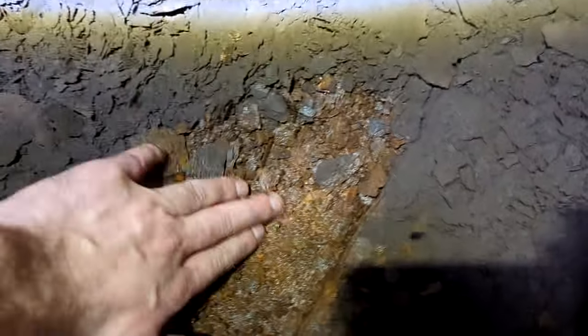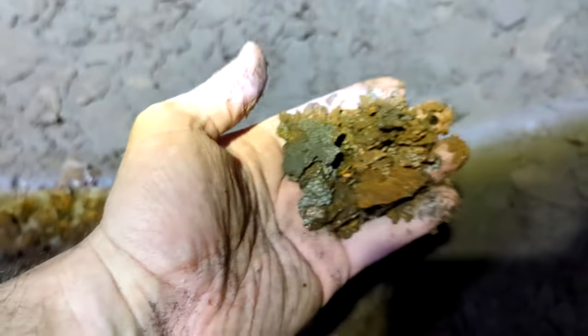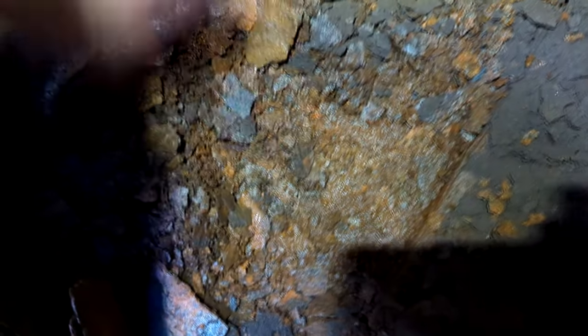I have a light down here. So this is what the inside of one of our tenders looks like. Up there there's a slope sheet where the coal goes. So this area would have all been water. You can see over the years just what holding the water has done to this tender — it's pretty rusty. If we look at the floor, there's about three quarters of an inch of rusty metal that is delaminated from the sheet below.